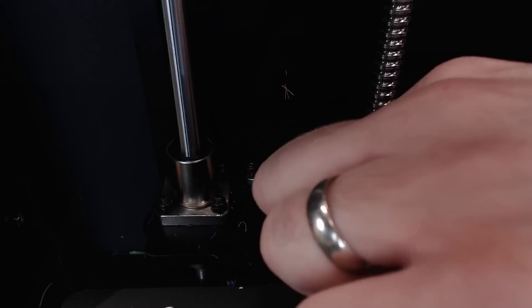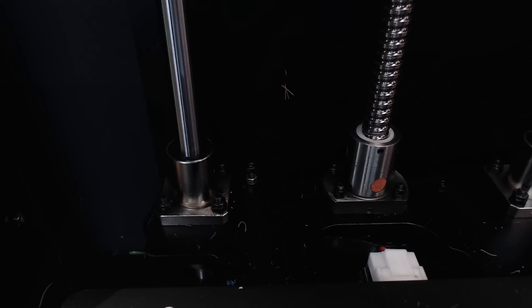One thing I found kind of annoying was this screw right here — that's what triggers your Z end stop. It's just threaded into the metal and it'll dance around in there and make your Z very inconsistent from print to print. I have two nylock nuts, one on the top and one on the bottom, securing it so it doesn't do that any longer. Just not a very good design.